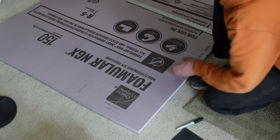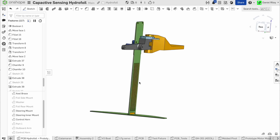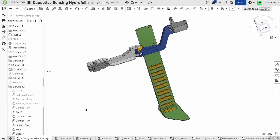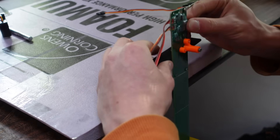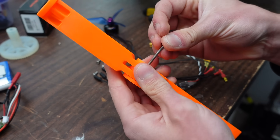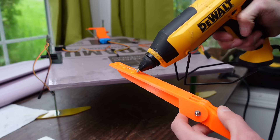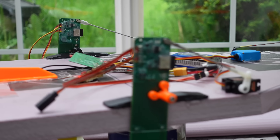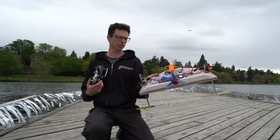At this point I could start testing in the lake, so I started building a simple test boat. It's going to be a tri-foiler, so we'll need the one rear foil to be able to steer. I designed some pivoting foil mounts in Onshape — those models are all available at the Onshape link in the description. I 3D printed all the pivot mount parts and hot glued them onto a flat foam hull. I knew this hull would have a ton of water surface tension sucking it down, so I'm putting the motor in the front and angling it down so that it blows air under the hull — kind of like a hovercraft. To protect the electronic components from water on the hydrofoil mast PCB, I covered them in hot glue.